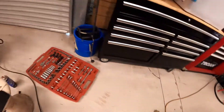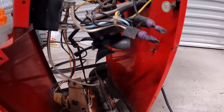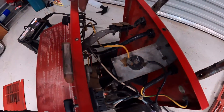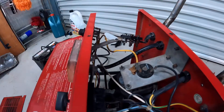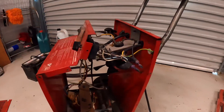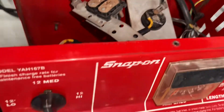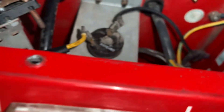Let's pull power. We're clean — everything's looking good. Got a Snap-on charger. One thing I did notice that I need to fix — that wire is actually worn through on that bar there. I might just cut that and put some heat shrink over it. Then we'll just put it back together. I think we're good to go. Maybe that was the reason it initially got pulled apart. Super basic bits of equipment though. We've got the two lots of heat shrink on that wire that was burnt through — plenty of clearance now, so we should be good.